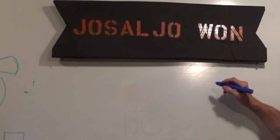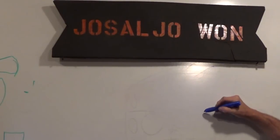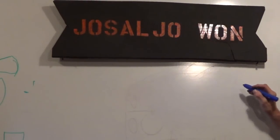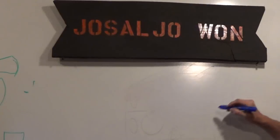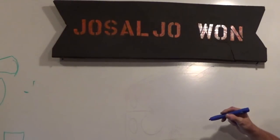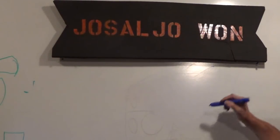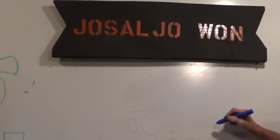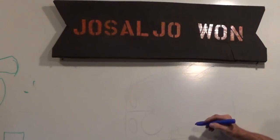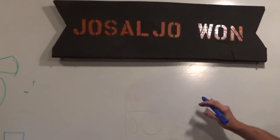Now, if the kiln has a moisture content that is higher than what's outside, which is rare, then you can open vents to be able to vent that and bring a different type of air in. Sometimes you can open it and bring heat in, depends on where the kiln is. Sometimes you can open vents and get moisture to come in if you need it. Why would you want to bring moisture into the kiln if it's already drying at a good rate?